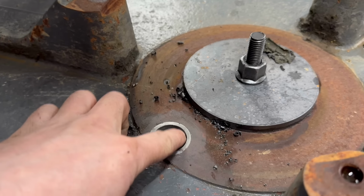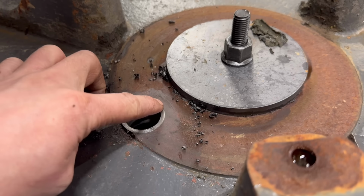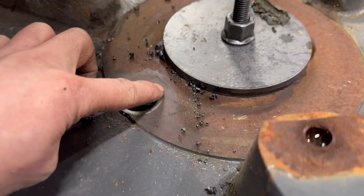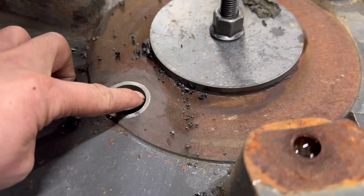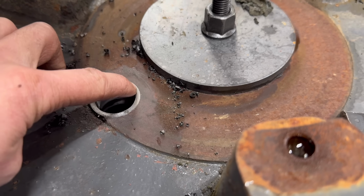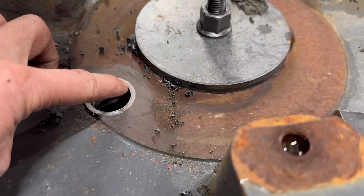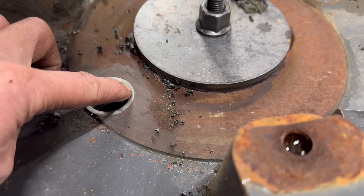So I put the drill in, put the truck back in and put the drill in, and then I usually move across 18.5mm, and then the grub screw is more into the flywheel than it is into the bush, and it's not taking any strength out of the bush, so it's just the threads that are holding it in, and it's not half and half.